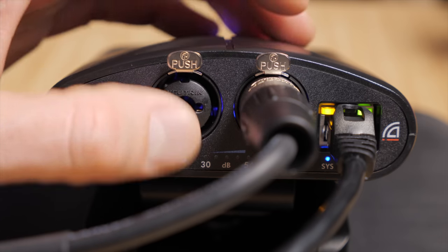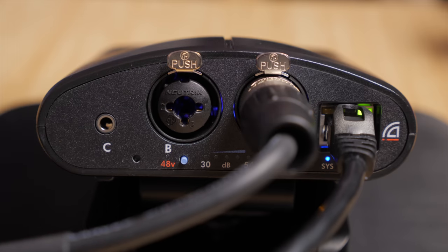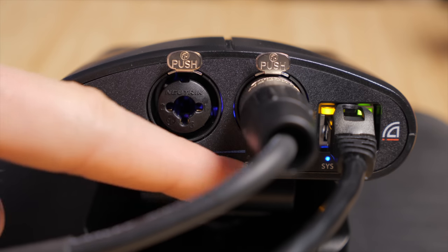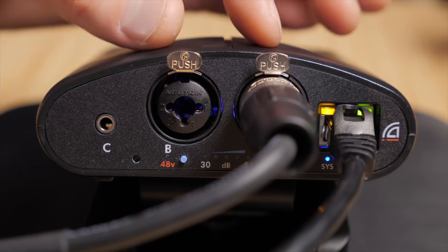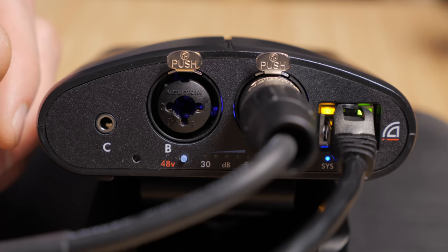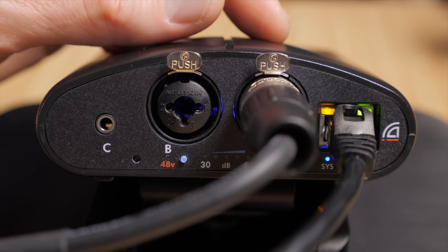These inputs are quite good — there's a combination input jack so you can do XLR or quarter-inch balanced. The XLR is a microphone level input and the quarter-inch is usable for line level input. You can control the gain for each input, and the matrix supplies up to 60 dB of gain for each microphone input. They're actually high quality microphone inputs — at 60 dB of gain the total harmonic distortion plus noise spec is 0.001%. It's using Burr Brown 24-bit Delta Sigma analog-to-digital converters, so these are much higher quality than off-the-shelf converters.